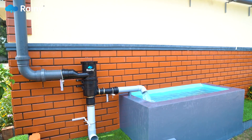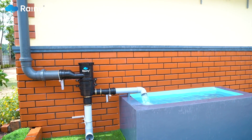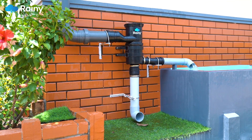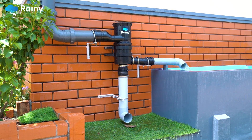Step 7: The filter should now work normally and minimal water should be seen at the drain outlet, ensuring high efficiency. Step 8: We recommend following this procedure from time to time, especially pre-monsoons, to make sure the system offers optimal performance.